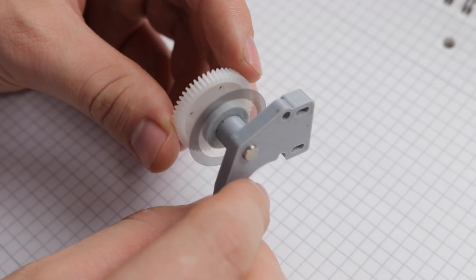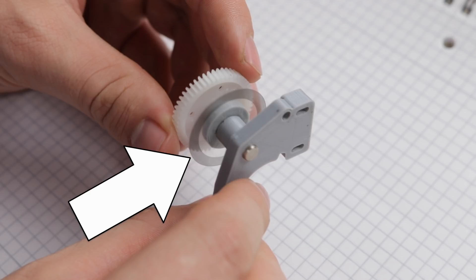Wait a second — what is that? Well, remember that we only have a regular DC motor, so there's no way we can get rotational feedback. And we need that for features like PID to set and maintain a constant speed or to precisely rotate to a target angle. So this is a mount that holds an optical rotary encoder disk. The gear on top will attach to one of the existing gears and drive this encoder.